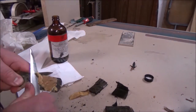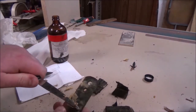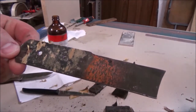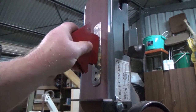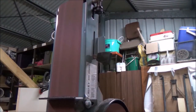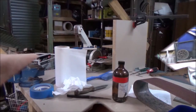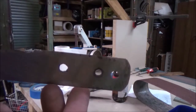It was a bit of a pain pulling that apart — double-sided tape on the inside, that nasty stuff, and then some cloth tape over the top. Pretty crude but effective. This is from over 20 years ago too. The sander was running away from me so I clamped it down, and it took about six minutes per side to sand all the pitting out. I'm constantly dunking it in water to keep it cool because I want to keep the heat treat as it is. That's a 40-grit finish.